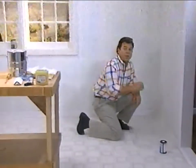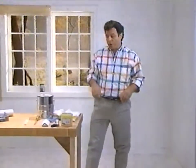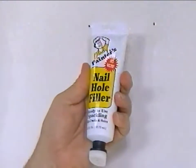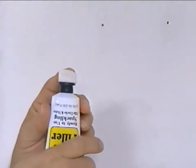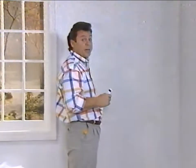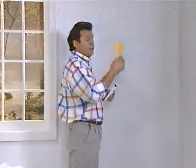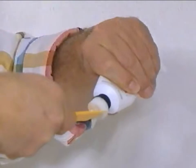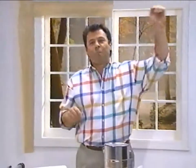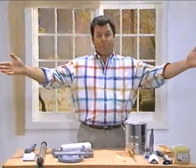Now we're ready to spackle and clean the walls. Use a spackling compound from any hardware or paint store to fill nail holes and cracks. Painter's Nail Hole Filler is a great product with spackling compound inside the tube and a handy applicator tip — just put it against the hole, squeeze, and press, and it completely fills the hole. If you don't have this, use your three-in-one painter's tool as a spackling knife with any spackling compound. You may still need to sand it smooth. Most people don't even have to wash their walls — just dust them and get the cobwebs out. If you have really dirty walls, the paint store can recommend a good cleaning solution.